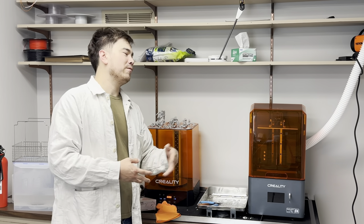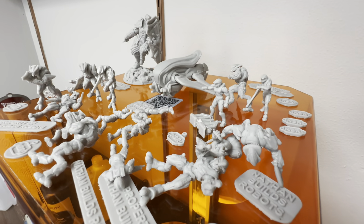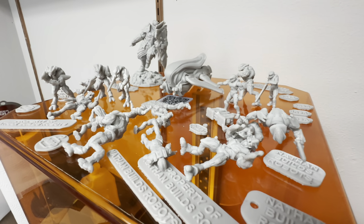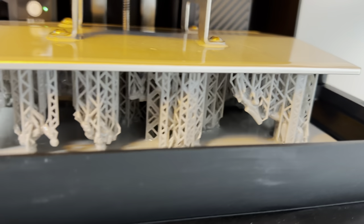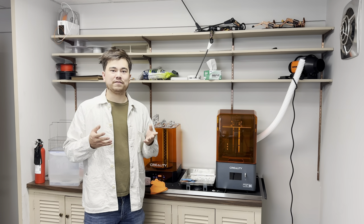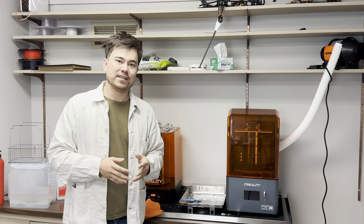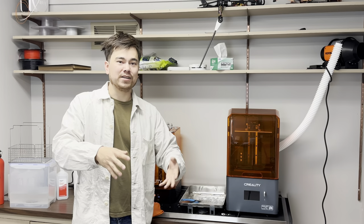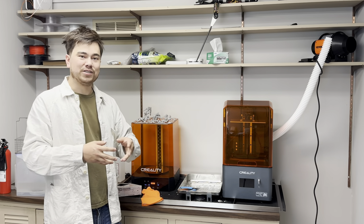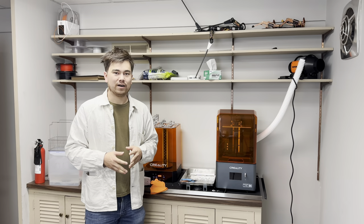With all those downsides you might ask why you'd want to get into resin 3D printing. It simply offers a level of print detail you can't achieve with FDM — the details on these prints are pretty astonishing and would be completely lost in the layer lines on a regular FDM printer. Also the ability to print things extremely rapidly in batches makes resin printers almost suitable for mass production. These photo-cure resins are also much more resistant to high temperatures than typical FDM materials like PLA — the material has to melt at a low temperature for FDM, whereas photo-cured resins don't need that, so when cured they're pretty tolerant to higher temperatures. And you can make extremely realistic miniatures that you really can't do as easily on an FDM printer.